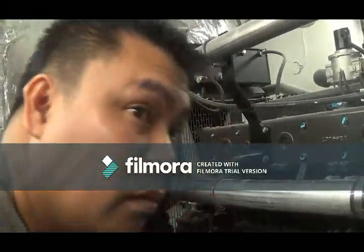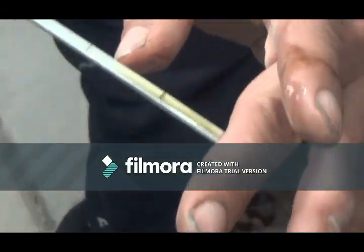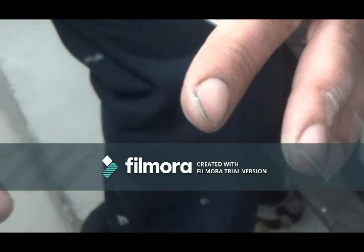You put the key in and start. You've got the oil gauge, everything's like that. You see where the level is right now on the camera? I like the second line. You can be in between, about three quarters towards the top line, but not more. If it's less, fill it up. You need to top it up.